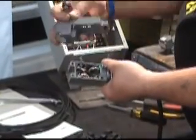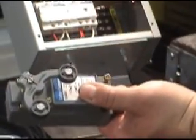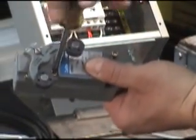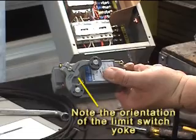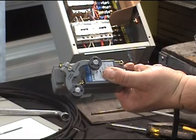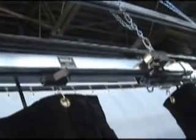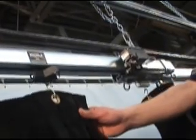Reassemble the upper and lower bodies of the switch. Remember the orientation of the switch's yoke is critical — it must match the orientation shown in the video. Remount the limit switch to its mounting bracket, with the yoke placed towards the back of the switch, facing the dead end pulley. Verify the limit switches are mounted correctly and operating correctly by manually operating the master carrier. The switches should switch in both directions as shown.